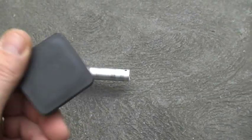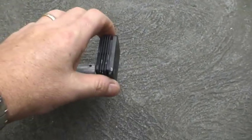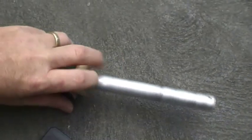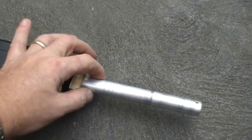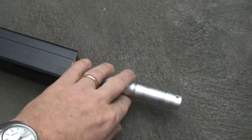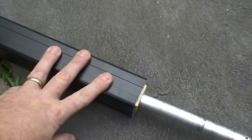Now with these ones, what I do is right in the centre I drill a hole to the size of the axle, and that can then slip over the axle and come down. That fits into the end cap. You will notice that even at that point the end cap will stop it coming off, but it will still slide back through. So what I do is put a series of screws through to hold that in place from the outside.